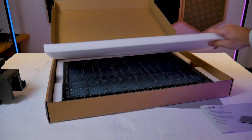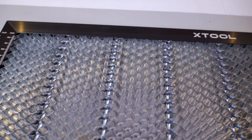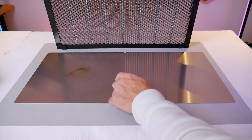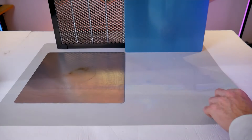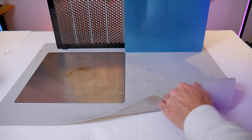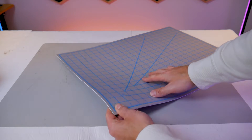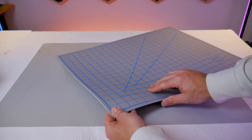We can also put controls in place to further reduce the chance of fire. When cutting through materials, you'll want to use a honeycomb bed with a metal backing on the bottom — aluminum is a great backing material for blue diode lasers. The honeycomb lifts the material off the work surface, provides an air gap removing heat from the tabletop, and allows the laser to pass through; by the time it hits the next surface, it's more or less out of focus and much less intense. You can also put silicone mats on your table, which are very heat resistant. Whatever you do, never use a PVC cutting mat as your bottom layer, as PVC can produce toxic gases when vaporized.